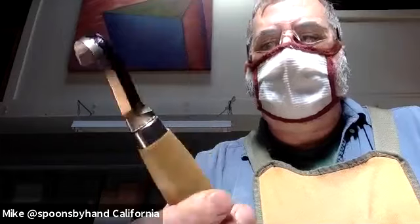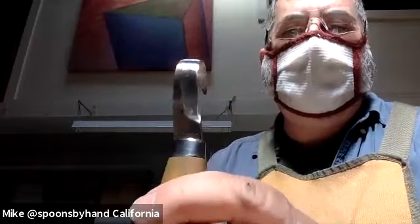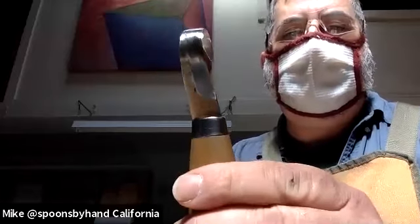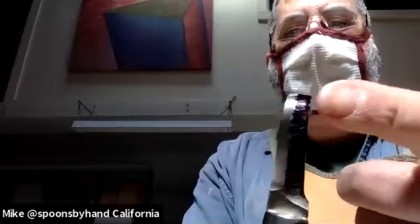Okay. So basically what we're doing, is it recording now? Yeah, it is. Welcome everybody to an impromptu Rise Up and Carve demo by Mr. Michael Bray. Ta-da! So this is a Mora 164, the modern one with the blunt tip. Somebody wanted me to alter it like we used to do with the old 164s, where we took away that blunt cutting edge and made it as close to a Scandi grind as we could. That's what's happening here. I have used a Sharpie to mark out the two facets that are going to become one.